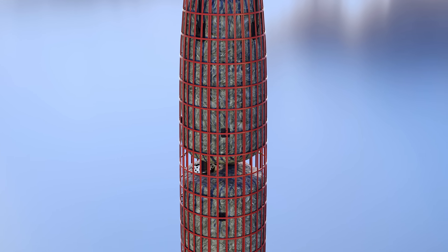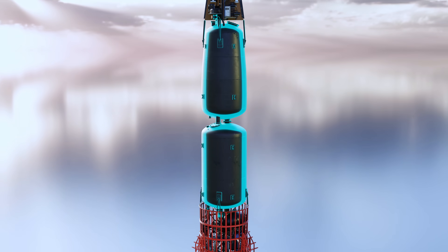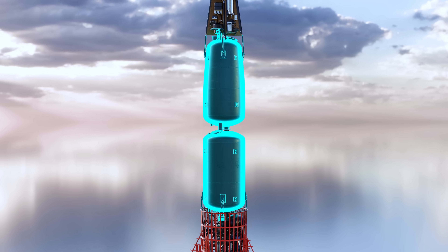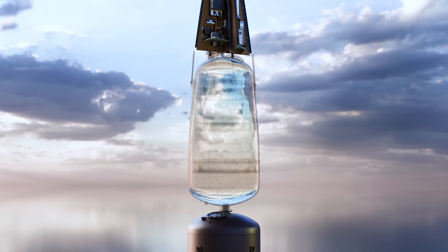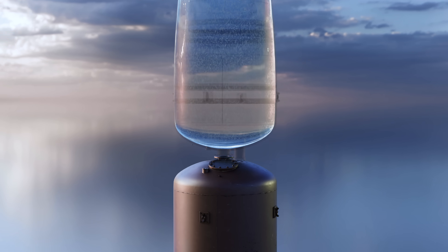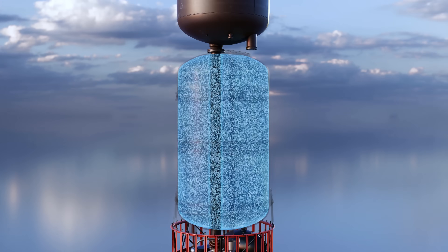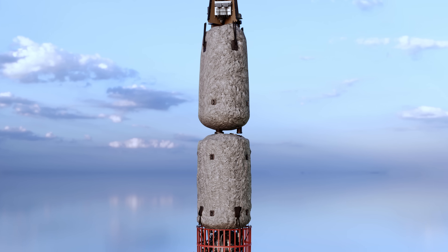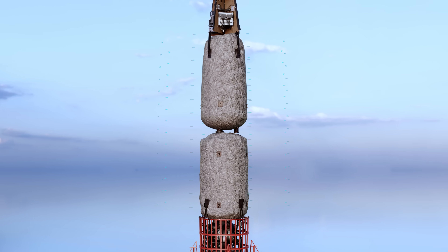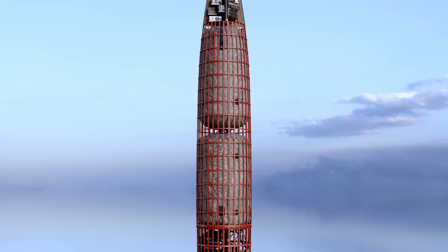The largest section was the center of the rocket, inside which there were two aluminium-magnesium alloy tanks. The larger of the two held fuel, while the smaller one was filled with supercooled liquid oxygen. Both tanks were insulated with layers of glass wool, pressed with wooden chocks to keep the insulation in place under heavy acceleration.